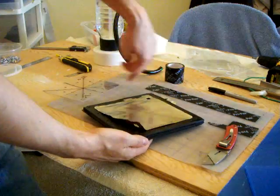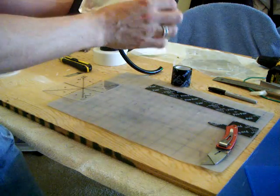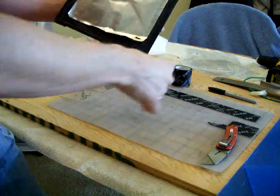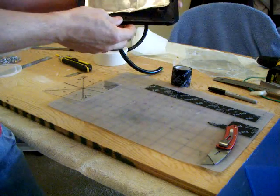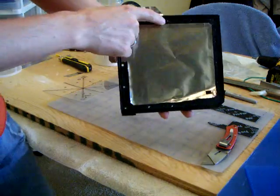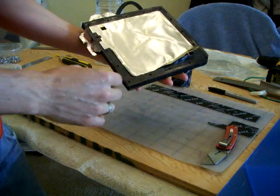After that, for the gasket all around, the same tape, two layers that I cut 1 inch wide. Glue it, stick it on the plate, so I have maybe a little bit of 5/8 left all around, and they stick together on top of each other. The good thing about that is that the cells stay together, and it's easy to drill holes to place the bolts all around. It makes sharp, nice, clean holes through this.